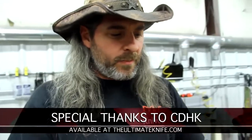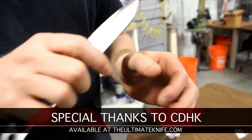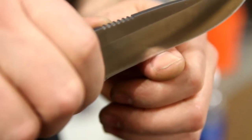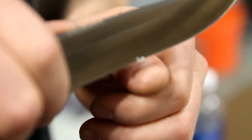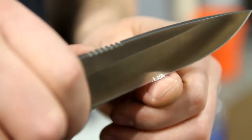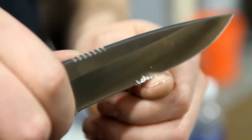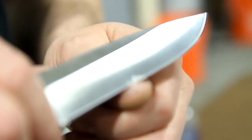Okay, so the other way that you can do is you can remove this calcium on the top of your thumb, your thumbnail, fingernail. Most people just kind of use their thumb. If you set the knife blade straight down and push forward, you should be able to scrape this just like so, getting that protein or calcium or whatever on top, just to scrape forward like so. It shouldn't slide at all. It should actually grab that stuff and just move it like a plow. You see that? This also could be representative of a razor sharp edge.